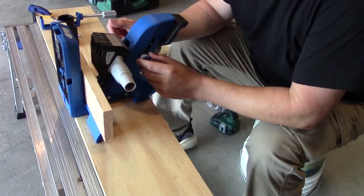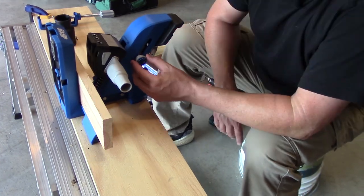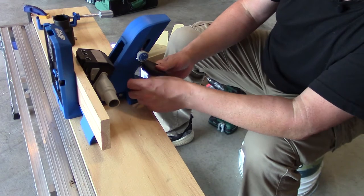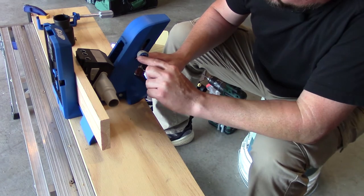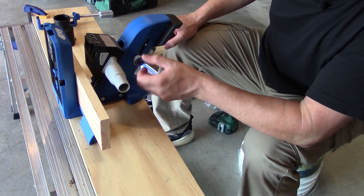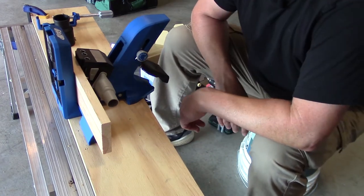Put our stock in place. How do you lock this in place? You just do that — it's that simple. Here's a little tension knob right here. Lift it up, and to adjust it you're just going to spin the knob when it's open. Here's a minus, here's a plus — you would think you'd turn it that way to loosen it up, but that's actually the tightest. Going this way is actually the loosest. I guess what you're doing is pointing the minus arrow towards the jig itself. I find that most of the time, right there in the middle, holds things really well — unless you're working with something crazy big or something that's wanting to move.